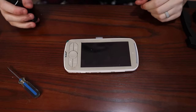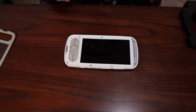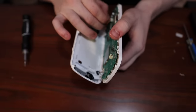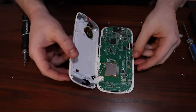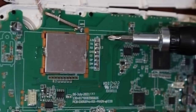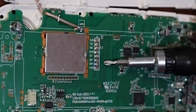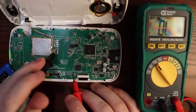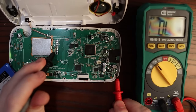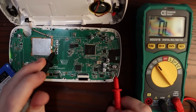After some fairly uneventful recon where I definitely didn't cut my thumb open, several screws are revealed that give you access to the rest of the board. There are some cables here we need to disconnect. That pops out pretty easily. We'll leave the board open like this. Now you may already see what I saw on the FCC diagram — here we have a row of pins that say 3.3, TX, RX, ground, and some others I'm not too sure about.